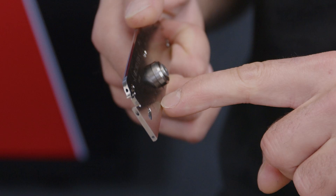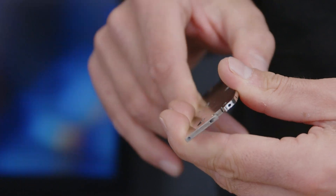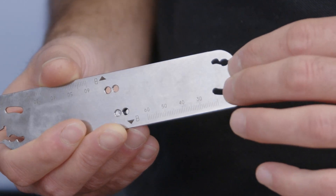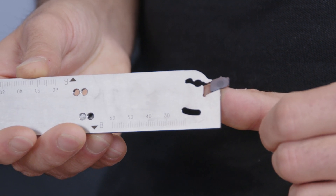The general parting blade looks pretty standard but it has some extra coolant capping options and two clear coolant tubes. If you're trying to get a parting off tool 50mm down into the part, a standard tube from a lathe is not going to get in there — it'll be blocked by swarf. That also helps with automated systems, ensuring coolant is always being applied to the cut.